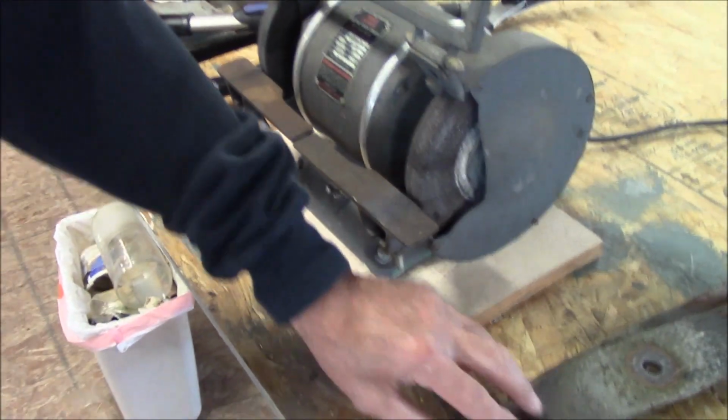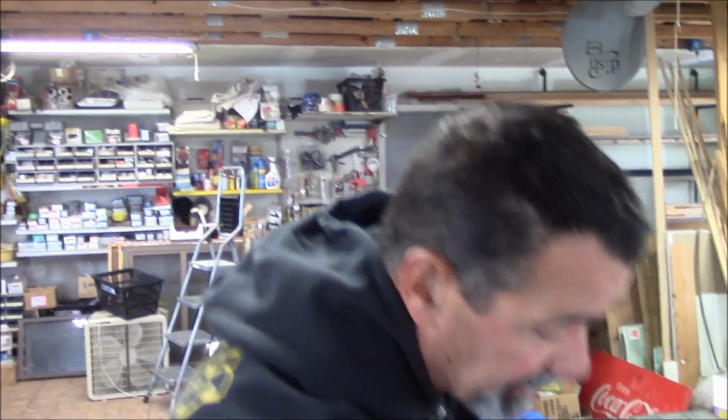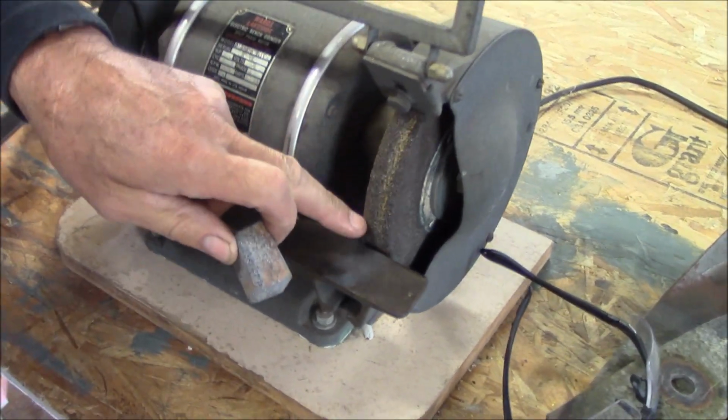Here we are on location in beautiful Harsons Island, here to show you how to get a grinder ready for sharpening some tools like lawnmower blades, edgers, and hedge trimmers. What's required is a dressing stone. A fancier dressing wheel would be a tool like this. Both of these are used to help get the crumb out of a grinding wheel.